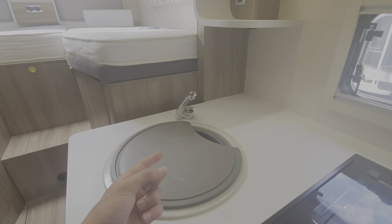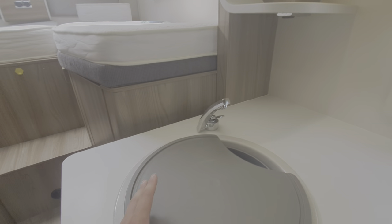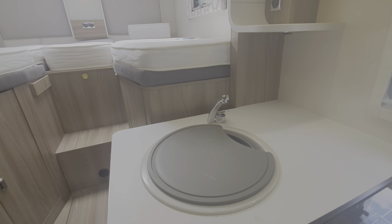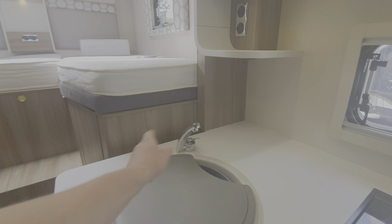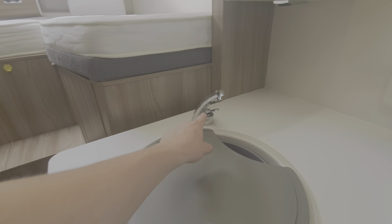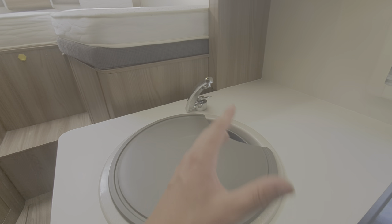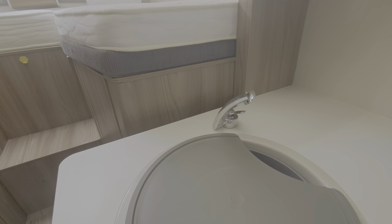Once you've done that, flick it over to cold and do the exact same. The reason I tell you to do it on hot first is this uses a boiler, which is not instant hot water — it's never going to give you instant hot water like at home because it's not as powerful. It's going to take approximately 30 minutes just to get up to temperature. So if you do that as soon as you arrive on site, get all your taps turned to hot and pull that water through the boiler — it's going to allow that water to sit in the boiler, and when you turn your heating on it will begin to heat. By the time you want to use your hot water, you will have warm water coming through. The nice thing with these taps is they each have micro switches on the tap, so they'll activate the pump for whenever you need it. So don't worry about burning out the pump after you've primed it and you've got water in, as it won't activate the pump unless your tap is on.